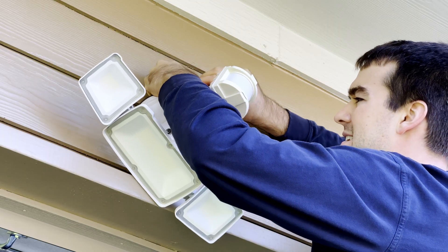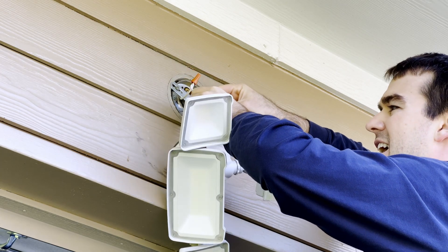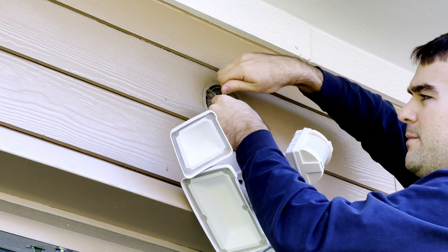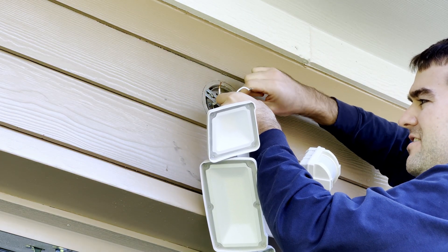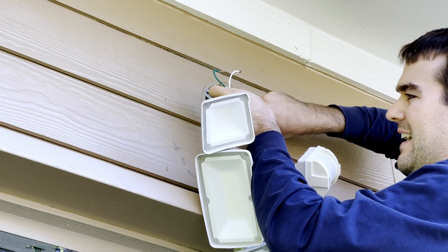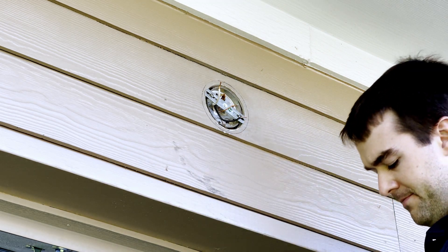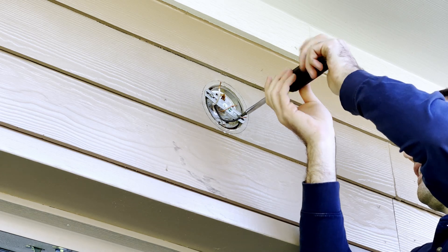We have a white, a black, and a green or ground. The switch goes straight to this outlet so this is a very simple swap. All I'm going to do is remove the wire nut by screwing counterclockwise. We've already checked that there's no voltage here. You could turn the breaker off but I just did it with the light switch on the wall. We've got our wires and then I'm going to unscrew this mounting plate bracket.